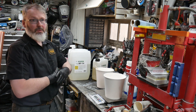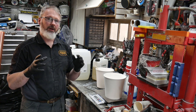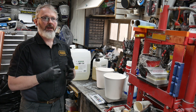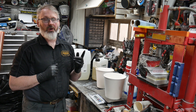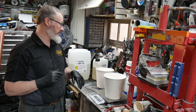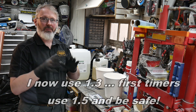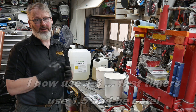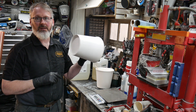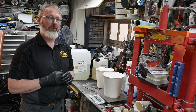I've done the calculations. What we've done is calculated the entire weight of all the carbon fiber elements in the stack, and multiplied that out — which is 2 kilograms — and then I'm multiplying that by a factor of 1.5. Again, I'm new to this and I've got plenty of material, so I don't mind being a little wasteful. I could economize on the volume, but I'm going to do what I can. So that's 3 kilograms total of epoxy needed to infuse that part.